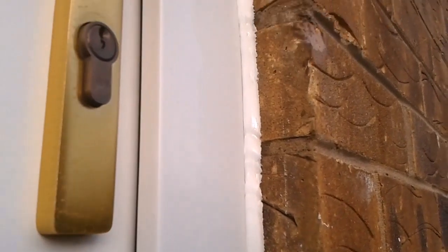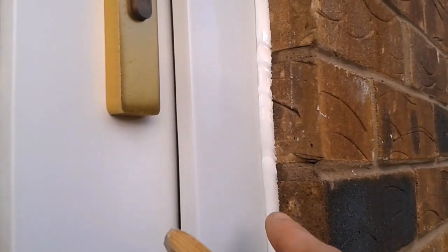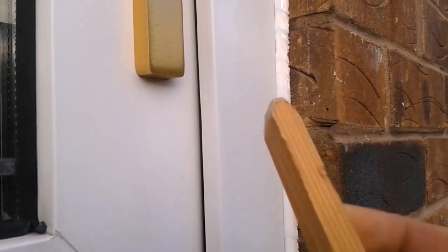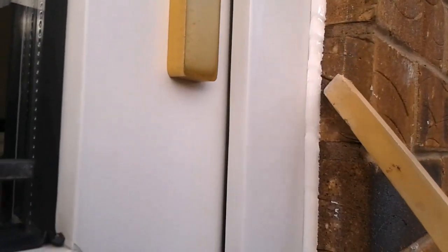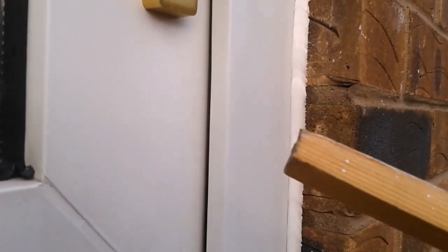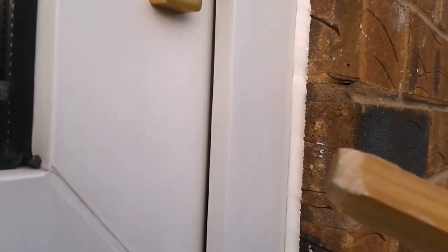Well, this existing silicone that was in, if you do need to remove something like this, then chances are it's not going to be bonded that good. All I did was use a piece of stick to disturb the silicone, distorting it, pushing it, forcing it. When the stick wears down, sharpen it so it's square again. That's the better edge that you want. As soon as it wears, sharpen it.